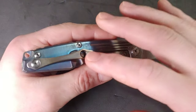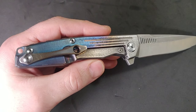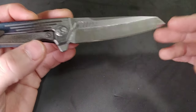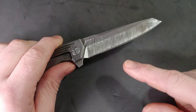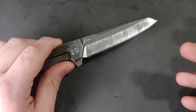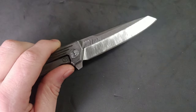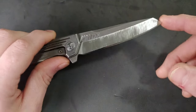You want to go up a grit pattern with sandpaper: 100 grit, 300 grit, 500 grit, 1,000 grit, 3,000 grit. But if you're going to do a regrind and thin out your blade, you want to start with a 50 grit, then move up to 100 grit to a 300-400 grit finish. Each side took me about 30 minutes, and then the edge was separate — I did put a nice edge on it.